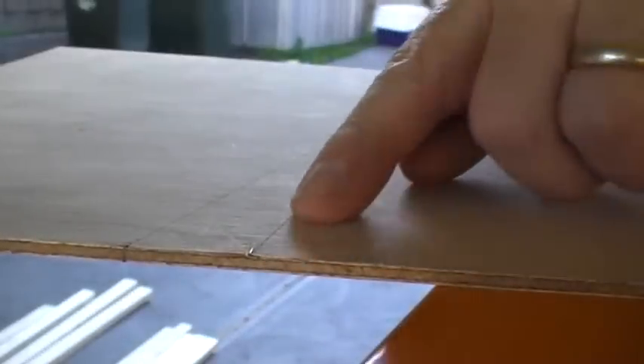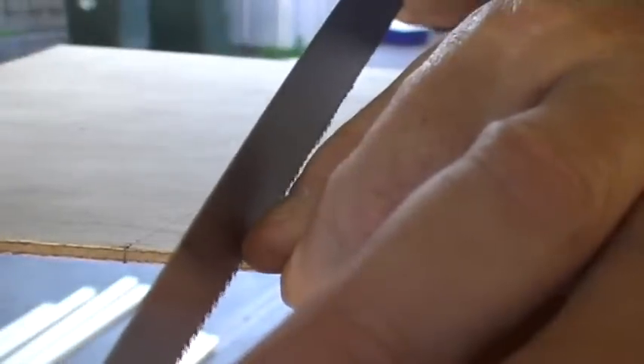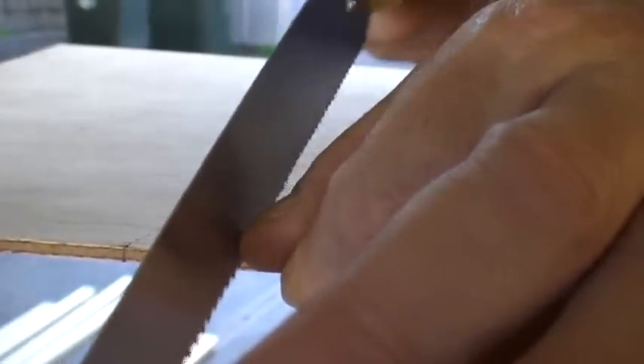What I do is take the line — here's our top corner on this one. Hopefully you can just see this down here, but I've actually marked the line down here. I actually use a sharp craft knife to cut through, and I'll show you the reason why once I cut it. Here's the line we're going to cut down. This is the little saw I use.